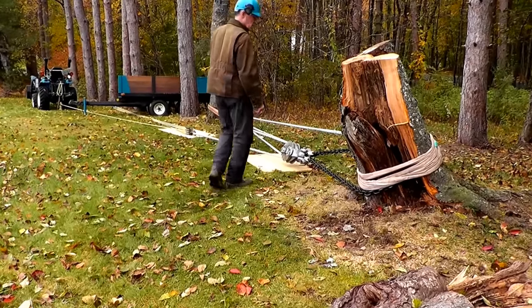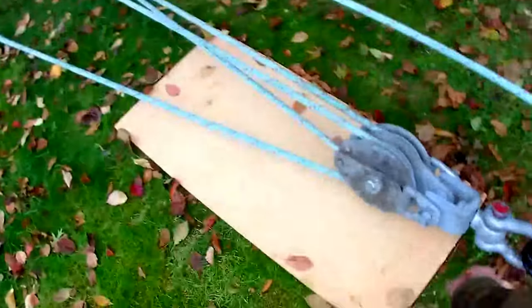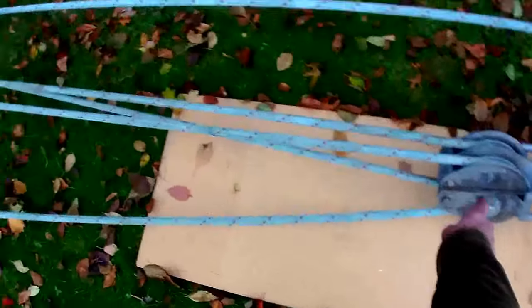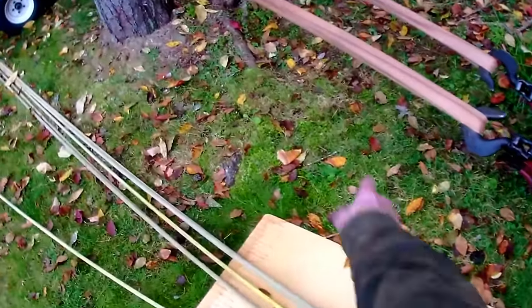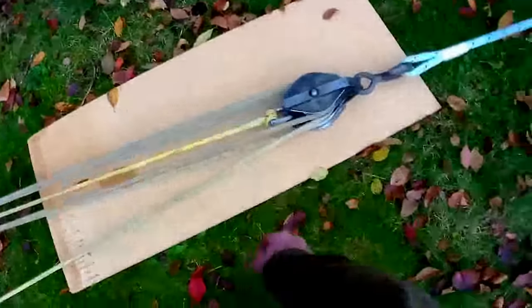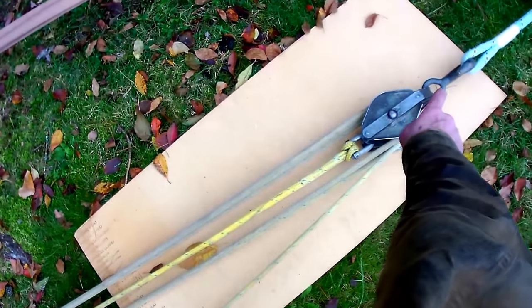It's 35 to 1: three attachments to the stump, a chain in a basket, and a rigging sling in a choker. A big double snatch block, a pair of 8-ton snatch blocks, again on a rigging basket, and that 5-to-1 is being pulled by a 6-sheave block and tackle.